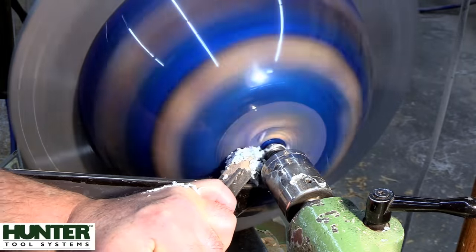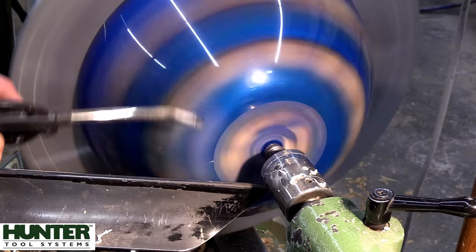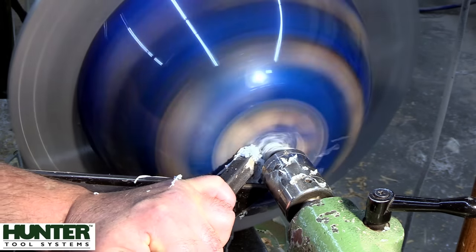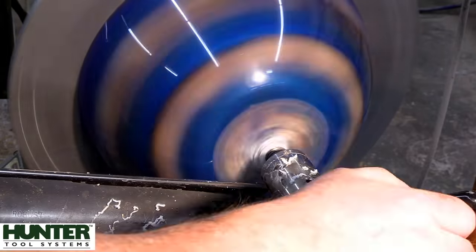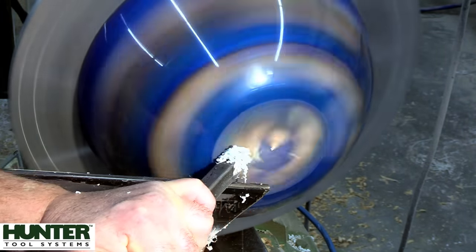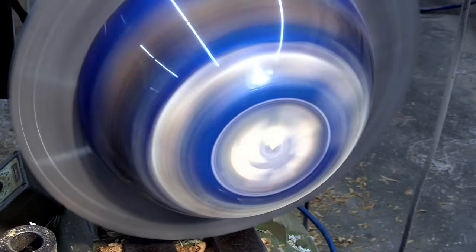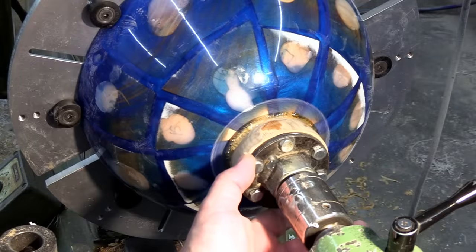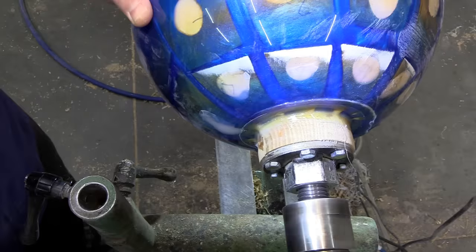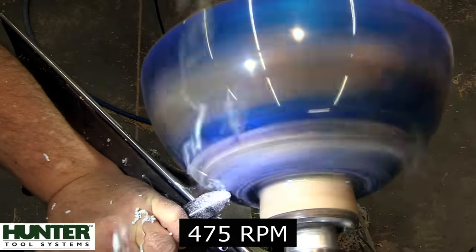So that was a little surprising, because keep in mind, every time you cut a piece of wood, you expose end grain. So I really did anticipate this eating more resin than this. And in a way, it's kind of disappointing, because I could have glued the pieces right up near the very top of that bowl and made this a larger bowl. But hey, I always err on the side of caution. Anyway, there's our glue block going on. Once that's all cured up, usually 10-15 minutes, I'll move it outboard and start trimming up.